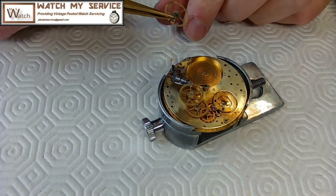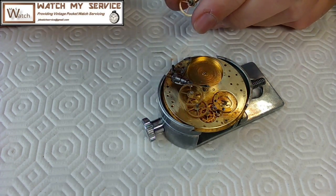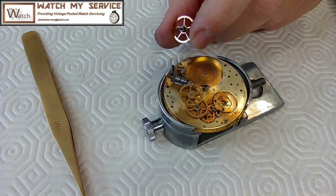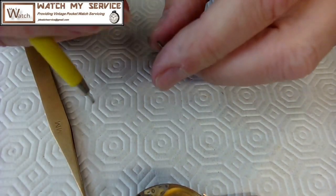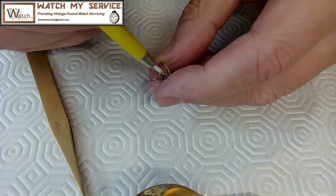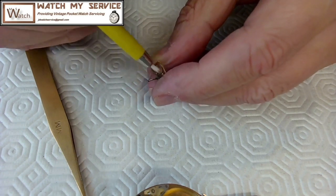The third wheel interacts here — pinion up. You've got to make sure you get the pinions in the right position or the dam thing won't work. So this one is pinion up. That one's down. I'm looking at this here and I see a little tiny bit of corrosion right in here — I want to attack it with my famous device. This watch was just corrosion central.